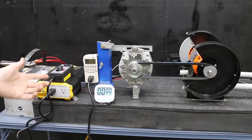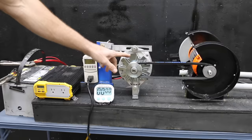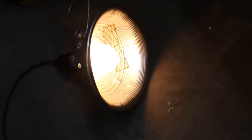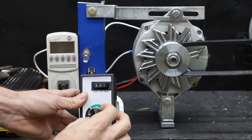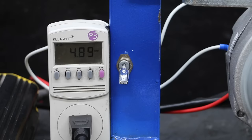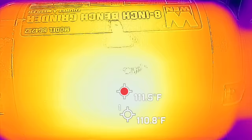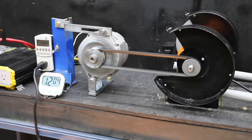I built an electric motor lie detector tester. All but one motor is rated for at least 3/4 horsepower. An alternator is connected to a fully charged car battery, which is connected to a power inverter with a fan speed controller and a light — this allows grinders to maintain their horsepower rating throughout the test. A power drill helps the grinders get up to speed since bench grinders don't have much starting torque. The test lasts right at 15 minutes. The Wynn is off to a good start, running at a little over 570 watts — very close to 4.8 amps — and is operating very close to its 3/4 horsepower capacity. At 10 minutes, the Wynn is very close to 112 degrees Fahrenheit.